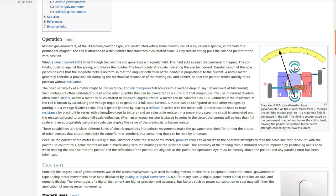These meters are generally rated at their full-scale current. For instance, one rated at 100 microamps indicates full-scale deflection, which lets you calibrate the dial and calculate the exact current being measured. In most cases this type of meter measures a voltage drop across a shunt resistor — a really low, calibrated resistor in series with the current path — so only a calculated fraction of the actual current passes through. With some math and a calibration chart you get the direct relationship between needle deflection and actual current.